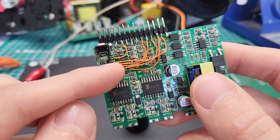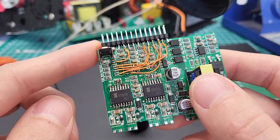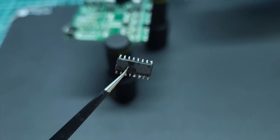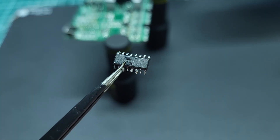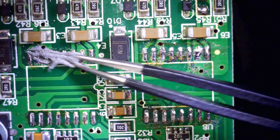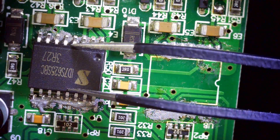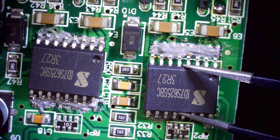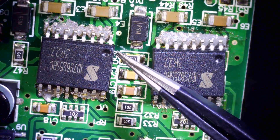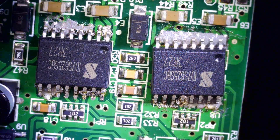The plan for fixing this inverter is to replace the original microcontroller with an external one — in this case an Arduino Nano. First I remove the damaged microcontroller — no marking left on it, so no way to identify it. Then I resolder the two gate drivers I had removed earlier, using solder paste and the reflow plate. Every time I do it I'm still amazed — the chip lines itself up with the pads absolutely beautifully.